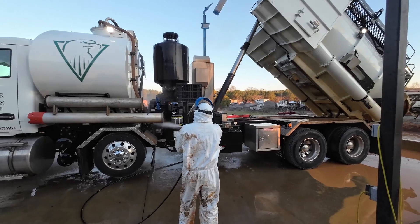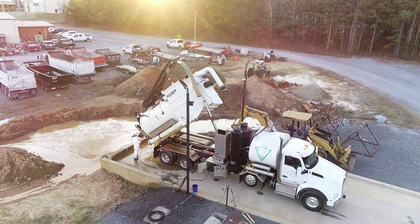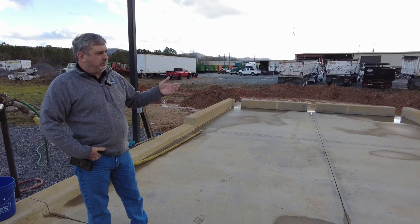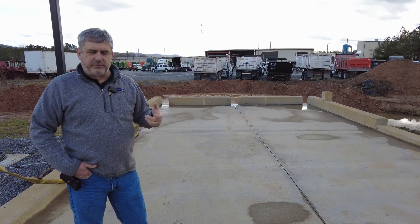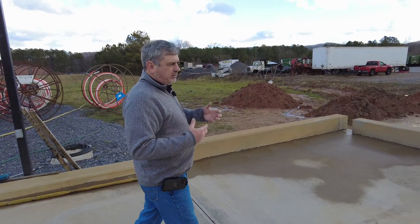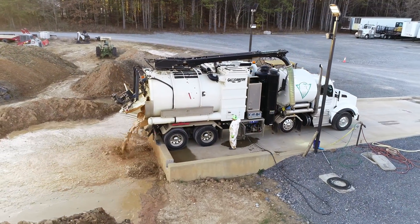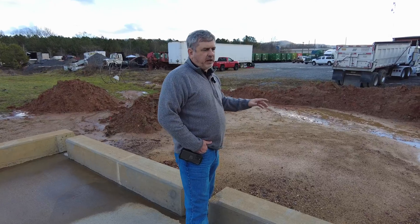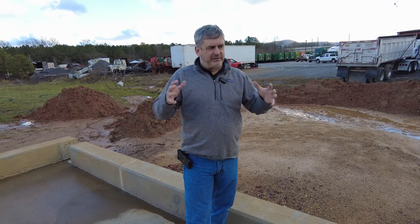The operator of the truck is really good at keeping it clean and maintained. If you go to a landfill or yard to dump the mud, it rolls back onto the truck, so we created this pad where we could do it ourselves. We're fortunate to be adjacent to someone in the dirt-moving business. It's amazing how much field dirt we can bring back — it's pretty clean, and he's impressed with how well it packs. When the mud goes through the slurry of the truck, all the solids and rocks get mixed in. When we dump it, it de-waters and cleans up. He puts the dirt in a pile, and when he goes to install it, the dirt packs back really nicely — it acts like GAB, graded aggregate base, which has big rocks, little rocks, and fines in different sizes, giving you high compaction.